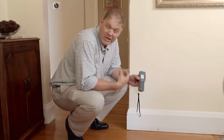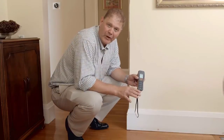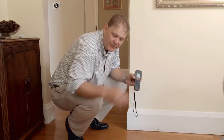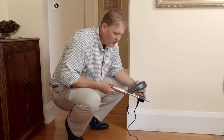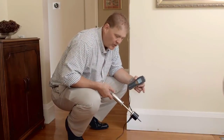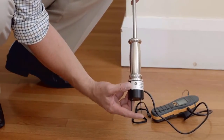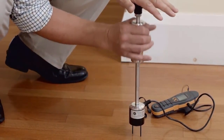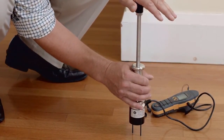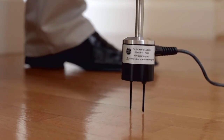For hardwood floors, particularly when restoring after flood damage, we recommend you use the hammer electrode with the Survey Master. This heavy duty hammer electrode can be used in hardwoods and softwoods and you can take moisture measurements as you drive down through the material. These needles are insulated so they only measure on the tip. It's important when using the hammer to drive it in straight and drive it out using the slide weight. This preserves the needles over a longer period of time.